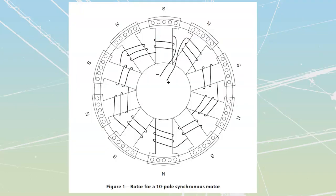It's the rotor that is the specialized component. The rotor has regular squirrel cage components as well as DC components. The rotor is a specialized build with salient poles — salient just means sticking out. We go with salient poles because we want the strongest magnetic lines of flux directly on these pole faces, not distributed between the poles, as that would weaken the synchronous action. With a salient rotor, this is a relatively low-speed type of motor, as you'd recall from studying alternators and generation.